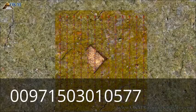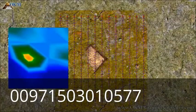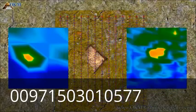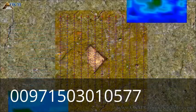This can also be influenced by decreasing or increasing the number of scan values per path. The more scan values hit your treasure, the better you will see it underground. A scan image with only 4 lines and 5 impulses is much less detailed than one with 13 lines and 35 impulses. It's absolutely recommended to repeat each scan in the same way with the same parameters — this is called a control scan, to make sure the values are valid.